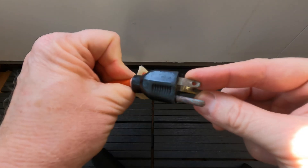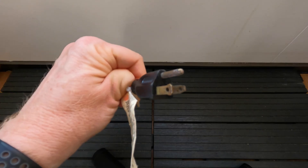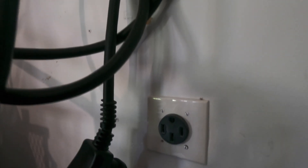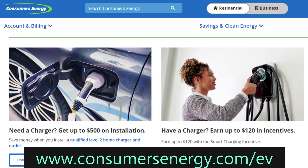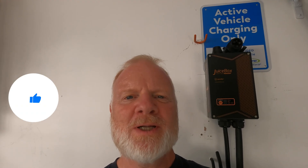Get yourself a new cord — it's worth the money to buy one with a thick wire gauge like 12 gauge or 10 gauge if you can, although most don't make 10-gauge 120-volt extension cords, and that's usually overkill anyway. Many people end up going with a high-power home charger that plugs into a high-power outlet like a NEMA 14-50. However, a lot of people can get by with just a regular 120-volt outlet. When you're ready to look at level two charging, I recommend contacting your local utility. Here in Michigan, if you're a Consumers Energy customer, go to ConsumersEnergy.com/EV to find out the latest programs including a $500 rebate towards a home EV charger installation. If there are other topics you'd like to see in the EV Basics series, please put them in the comments. I hope that was useful and informative — thanks for watching.